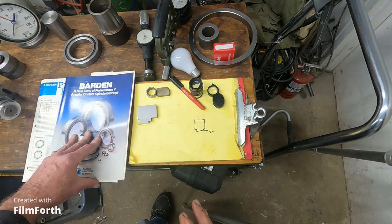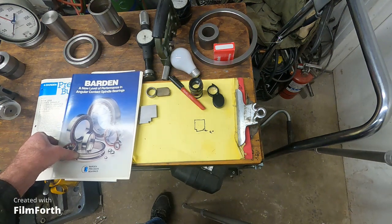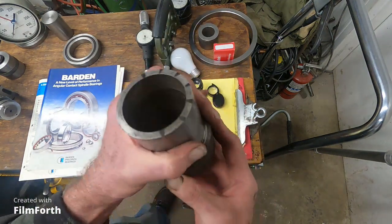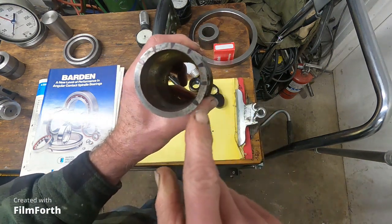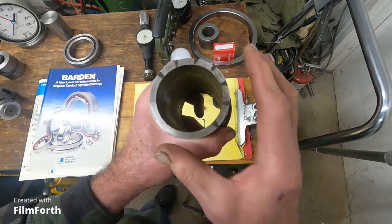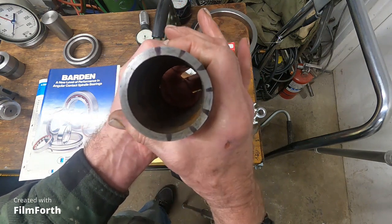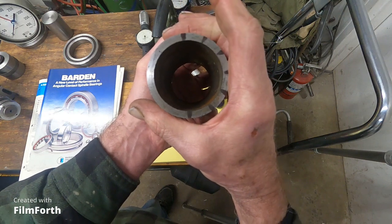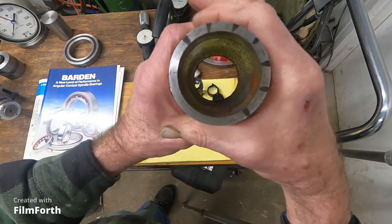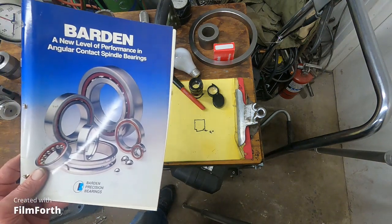You can build spindles, but you have to slow down. If your lathe won't hold tolerance due to runout — like the Axelson that needs spindle bearings adjusted — first adjust the spindle bearings. If that still doesn't work, make the part a thousandth or two oversize, then make a cast iron, brass, or lead ring lap and ring lap it to get to the roundness tolerance you need. There's always a workaround.